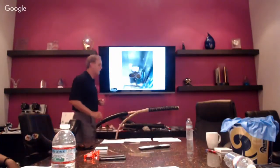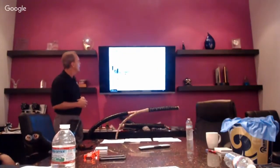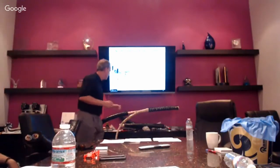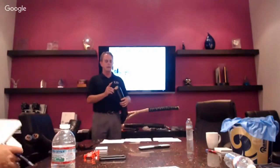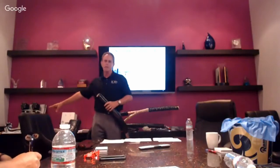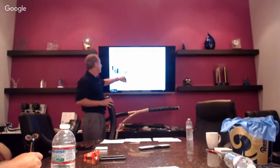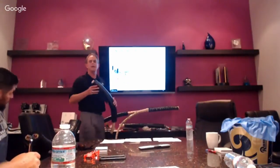All right, where are we at now? I think we're at the towers. That we are. So we run these beer lines with the conduit, comes out of the walk-in, run the glycol through, everything's touching all the way through the leader lines, and we'll go over that in just a second, up to the tower, and that glycol runs through this cooling block and keeps everything nice and cold.